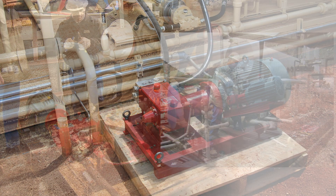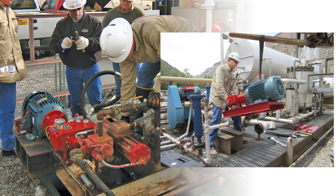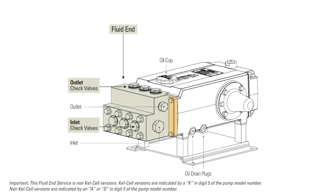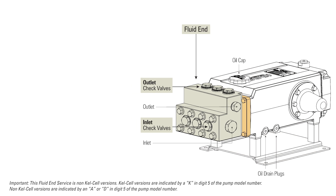As long as it is isolated from production, the electric glycol pump can be repaired on site and does not need to be separated from the motor. As long as you have enough space below the pump to collect the used oil, you may choose to leave it in place. We will not be repairing the motor in this video. The front of the pump is the fluid end. The large center portion is the hydraulic section and the back of the pump is the crankshaft end. We will only be working on the fluid end.